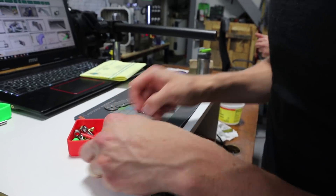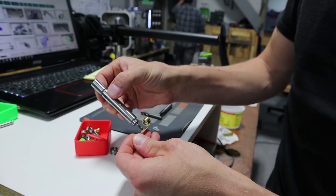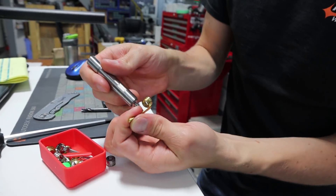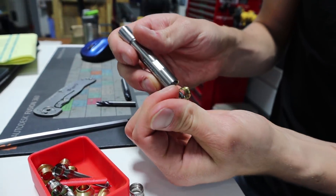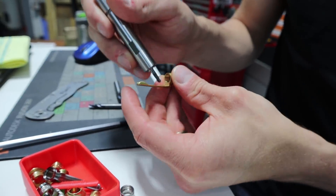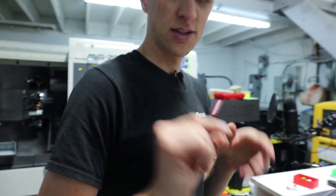When making a clip, there's the turning, the drilling, and then a lot of 3D machining. I have to make sure my end mill stick-out is good enough to reach — it'll barely clear but it should. Basically every surface in here is 3D machined with this ball end mill, including all the top chamfers and corner rounds. I want this tool to last, work really well, and have no runout, and I think this will be an awesome solution. Thanks for watching Saga Saturday everybody — stay tuned for next week, we'll get right back into it.